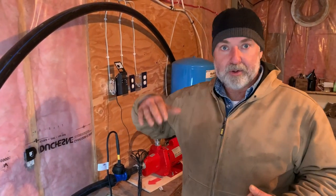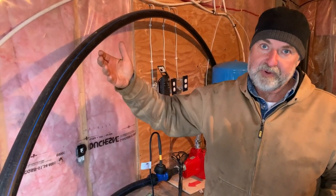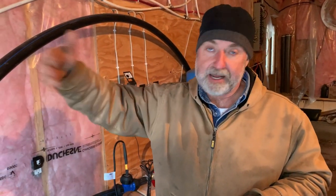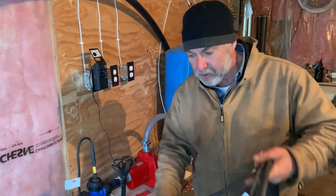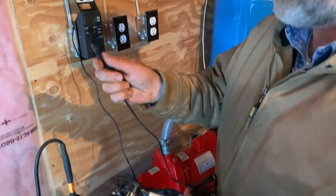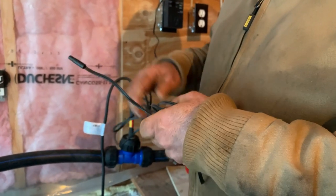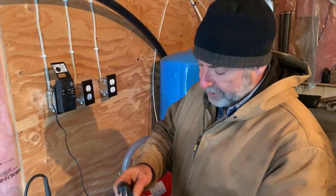Here we are in the building where the water flow starts from. This is the water pump. This pipe is the one you saw earlier — the one we covered in foam and PVC plastic — it's come into the building now, and this is the cable that we taped to the outside. Once inside the building, the cable doesn't need to be fastened to the pipe anymore because we're in a space that will be heated. The heating cable plugs into this thermostat here. The thermostat has a temperature probe that follows the water pipe out and gets installed inside the PVC within the insulation surrounding the pipe, and that feeds information back to the thermostat telling it to turn on or off accordingly.